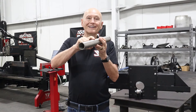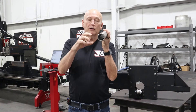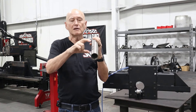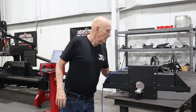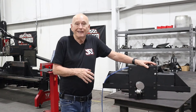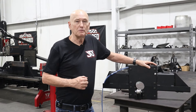It has transfer balls inside it that will automatically engage onto your tubing in order to support the material while it's being cut. However, when you're not cutting, we retract the transfer balls off of the material, and what that does is it helps pretty much minimize marring of the tubing while we're rapidng up and down the machine. So the best way to describe the principle of operation is to look inside. So without further ado, let's open this thing up.